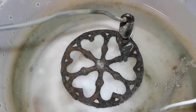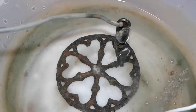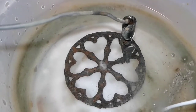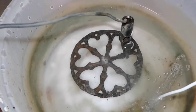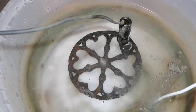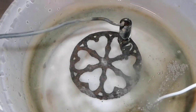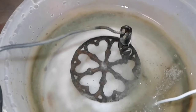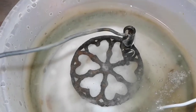Try and do some electrolysis on a relic — it's fun. I have three big axe heads outside that I need to get done that I found back in November. I want to try and do them like J3B did it — Digging Canada with J3B. He scrapes them, cleans them, puts them in the oven, cleans them some more, does electrolysis, then puts them in the oven with wax, melts the wax right to them — and they look beautiful when they're done. I want to try that with the axe heads on a nice cool day.